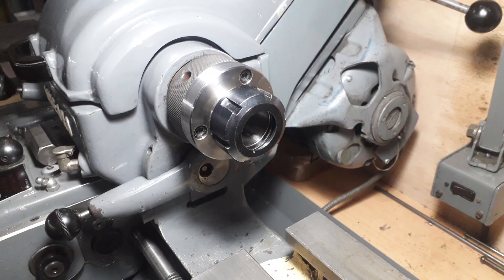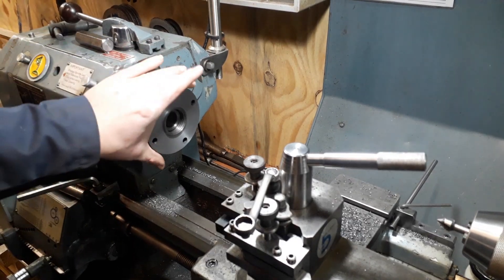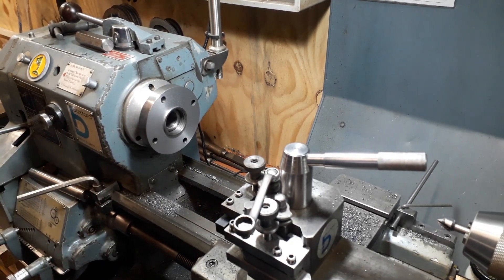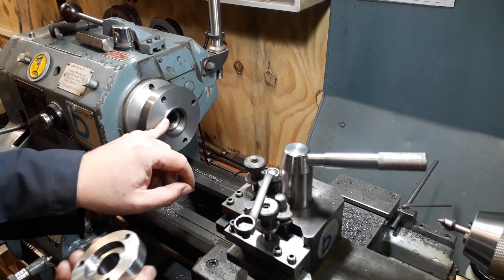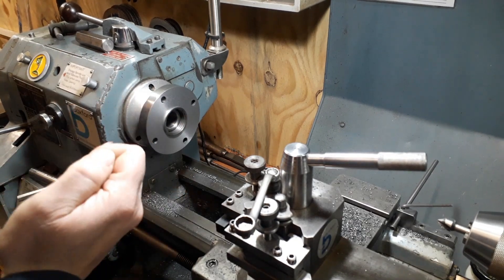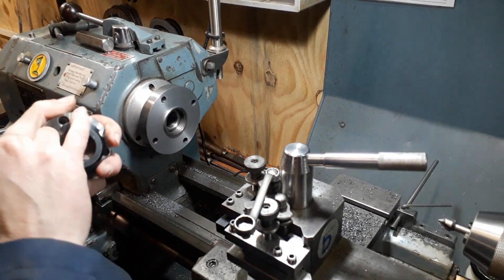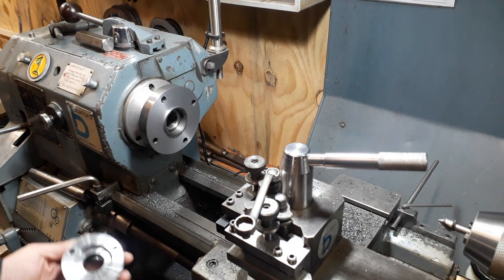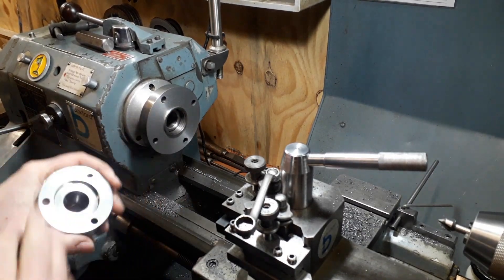This is it fitted to the Myford Super 7, as I use this a lot - very accurate little chuck, brilliant for bar stock. What we've already done is mounted the back plate on there. I've just taken a light skimming and removed the original register, and what we've got to do now is machine this down to fit into this register. I've got it a few thou off and I'm going to make a little step. There's just enough meat left after the threads - it's not perfect but it'll do the job, because the three bolts will be holding it on and it's only the register to give it the centralisation. I'll speed this video up a little bit - it's only a bit of machining and then we can get on to drilling the three holes on the rotary table on the milling machine.